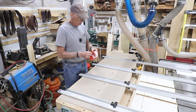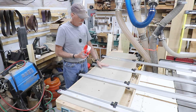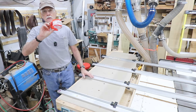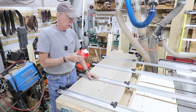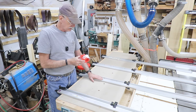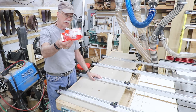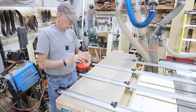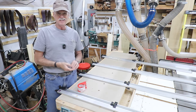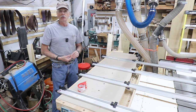We're going to be cutting them out in a minute, but here's a tip: if you're using flat clamps, wherever the glue joint is I put down clear plastic packing tape. The glue really won't stick to it and it keeps the glue off the clamp. I recommend the Staples brand tape - not a sponsor - it comes off the roll a lot easier than most others and sticks just as well. Let me get this cleared up and we'll do some table saw work.